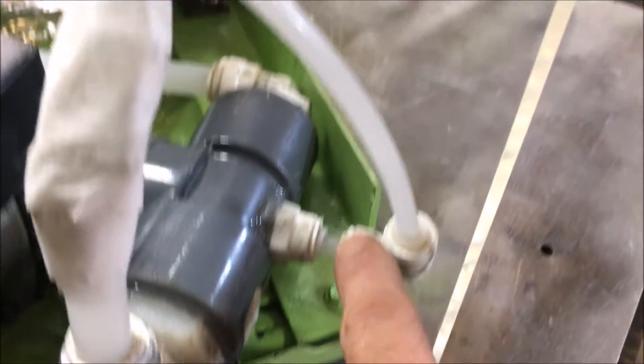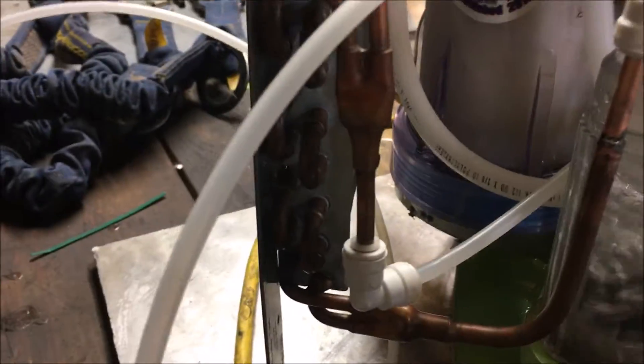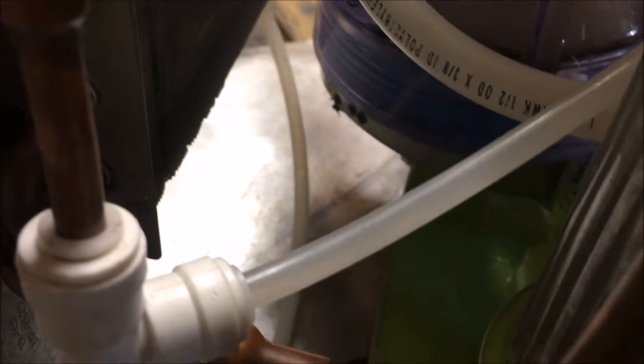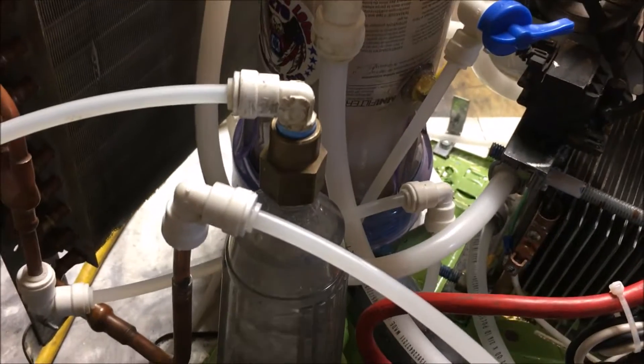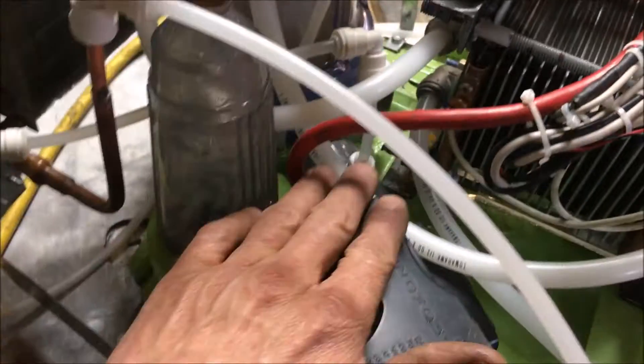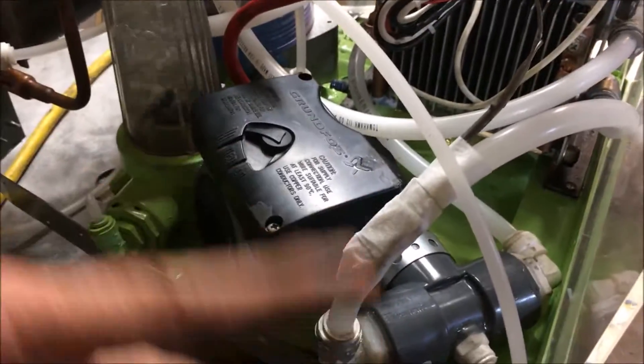Not only is the pump forcing electrolyte into the cell, but it's also forcing electrolyte up into the radiator here and pumped back — you can see the flow and bubbles there, flowing quite nicely. However, that is not conducive to cooling — you don't want high-speed flow, it just heats the fluid. I'm basically just pumping it right back into the intake side of the pump. I thought that would produce the highest vacuum because not only of the Venturi effect, but the vacuum of the pump itself in that region — I felt that would be the optimal place to reinsert the fluid.